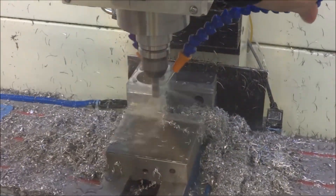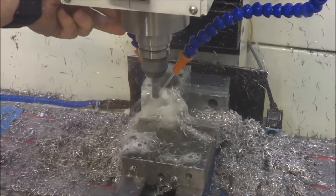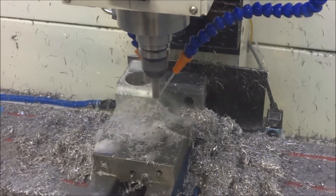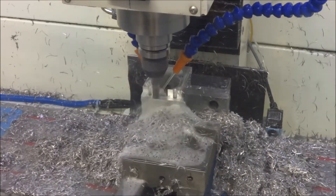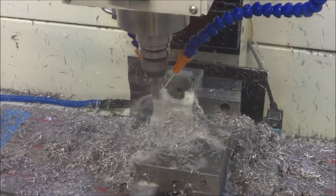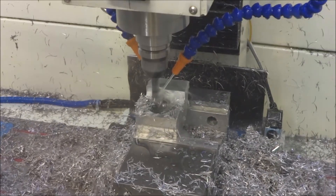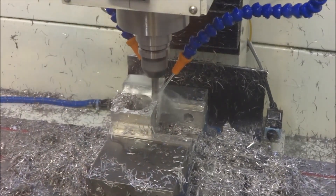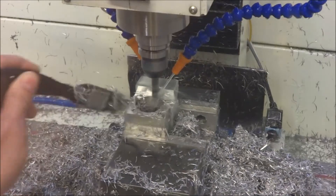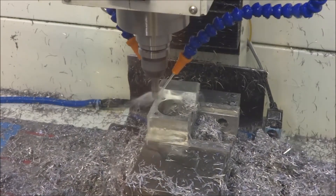Here I am making a step — this kind of locks in the ball nut and also keeps the bottom nice and flush. It gives me just a little bit of extra travel on the Z. I'm using a three-eighths inch four flute end mill, 35 thousandths width of cut, 30 inches per minute, and a 2.5 thousandths chip per tooth. I could have gone a little more aggressive with the width of cut — I'm still learning with the feeds and speeds.